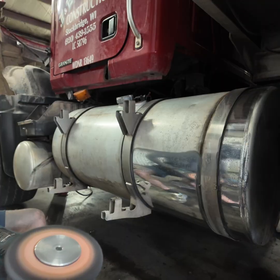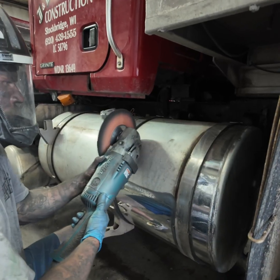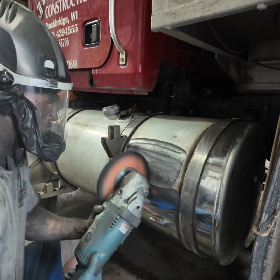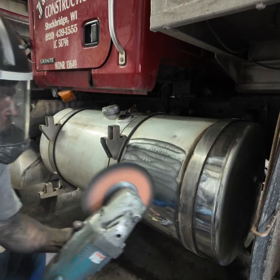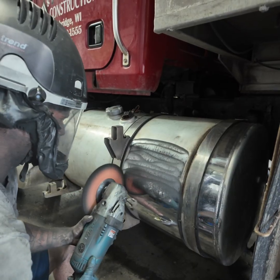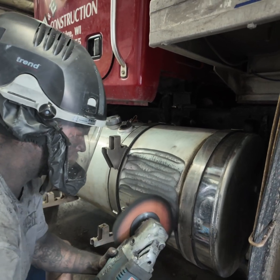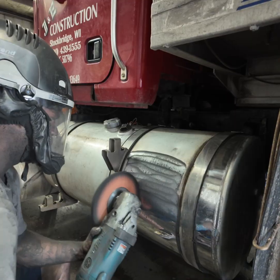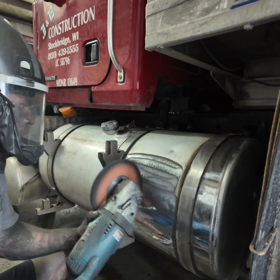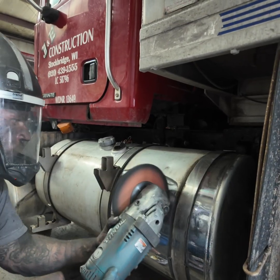And as y'all can see, it's a pretty rough tank. It's a work truck. Like right here where it's really rough, I'm just going to do a little back cutting just to pull my pores the opposite way. Get them opened up and get them pulled the opposite way. Whenever I rouge up and cut up, I'm building heat and moving. Keeping tight passes, good pressure.